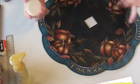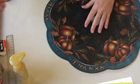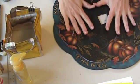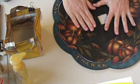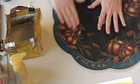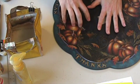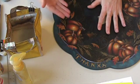So we're going to take our wet sanding disc, and there's two sides to it, and they're pretty much the same, so you can use either side. This always freaks people out. The one thing you have to have is at least 3 to 5 good coats of varnish on here. Otherwise, you are going to be toast. If you don't have varnish on here, then it won't be protected and you'll sand the paint off.